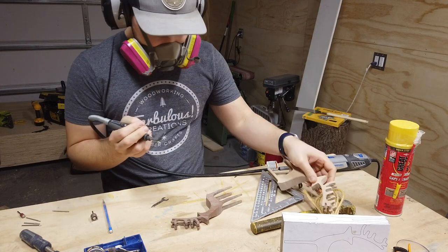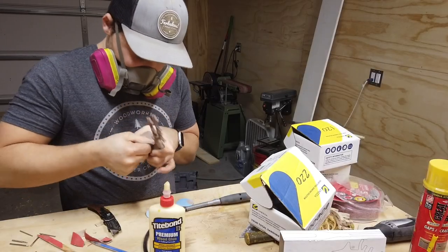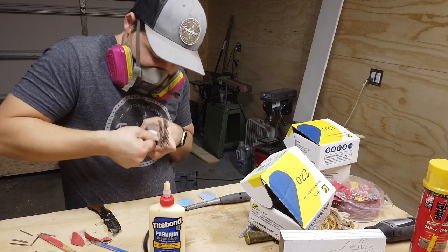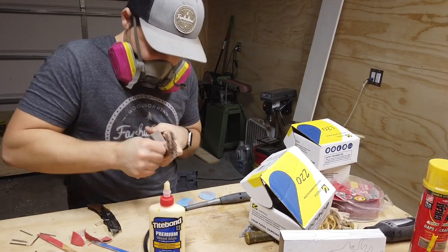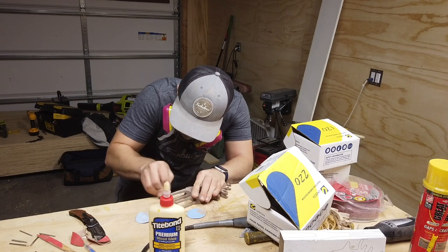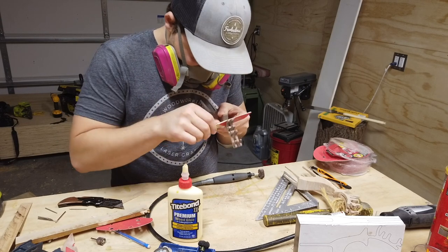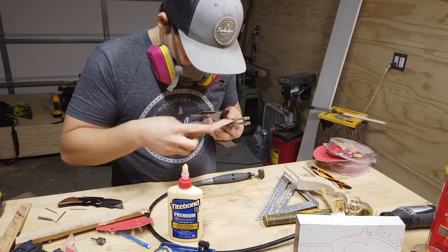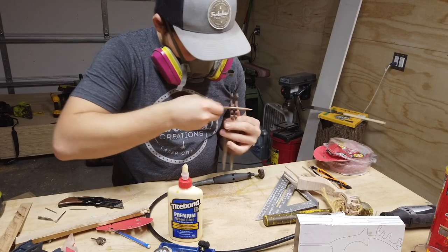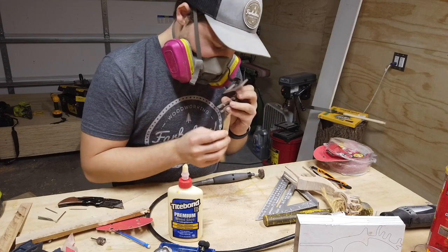With both reindeer cut out, I could focus on cleaning them up and sanding them. I used a bunch of sanding and carving bits in my Dremel to tidy up the lines within the grooves of the antlers, but for the body as a whole, I realized it was going to involve a lot of hand sanding if I wanted these to be super smooth. I progressed through the sanding grits, going as low as 60 grit to clean up all the bandsaw lines, progressing up to 400 to get a super smooth finish. Getting into some of the areas such as between the legs was too difficult by hand, so I wrapped sandpaper around a dowel to create a makeshift manual spindle sander, and I also glued a piece of sandpaper to a thin strip of wood, making what was effectively an emery board or nail file. All in all, I probably spent about 15 minutes cutting each reindeer out, and then probably over an hour sanding each one — but it makes a good excuse to catch up on podcasts and audiobooks.